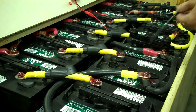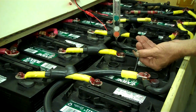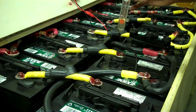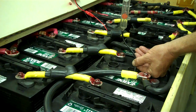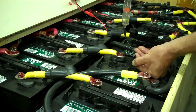Now that I've confirmed that all my water levels are good — or actually when they're fully charged, it's pretty much acid levels. Don't get discouraged here on this part. You've got to get rid of that air and eventually that disc will float up there if your battery bank's in good shape. You pretty much want to keep these things floating. 12.6 sitting there doing nothing is a fully charged battery bank. That thing's going to come up eventually — trust me on that. And there she goes. Got to get rid of that air.